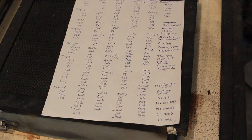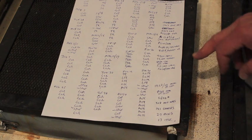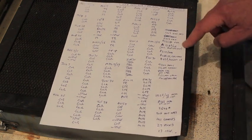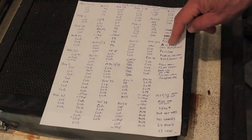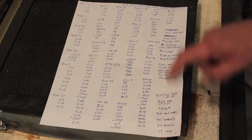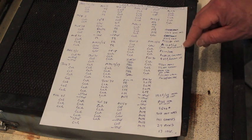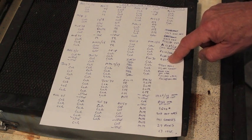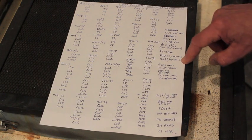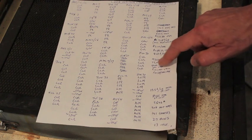When I run it up, that takes 2 extra days for heating. My per-pound melting cost was 12.8 cents a pound, including my days off and running up the furnace. I ran it up 27 times, so that's a lot of heating up over the years. But my actual melted per-pound cost of producing glass while the furnace was hot was 8.67 cents per melted pound. I calculated I made 9,200 items and took 23,000 gathers.